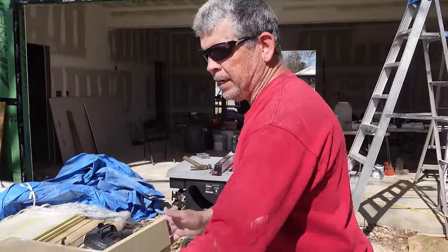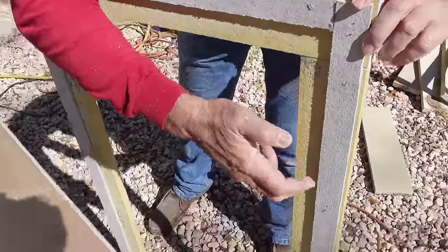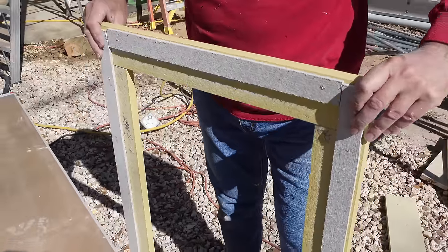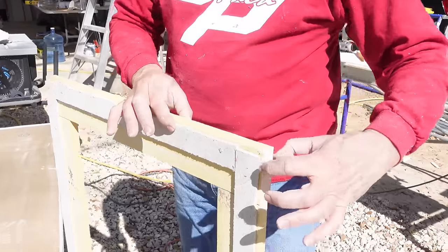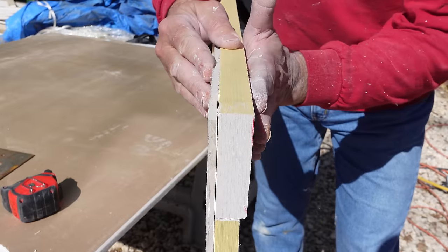And then on the back, what we did, we had some 1/4-inch scrap panels of Hardie. So we ripped these strips and we stapled them to the back of our frame. Does two things for us. It keeps it together so we can hoist it up the scaffold in one piece. That's always nice. But really more importantly, it's making this whole unit thicker. The whole window sticks out 1.25 inches from the building. So by doing this, this will be flush with the window.